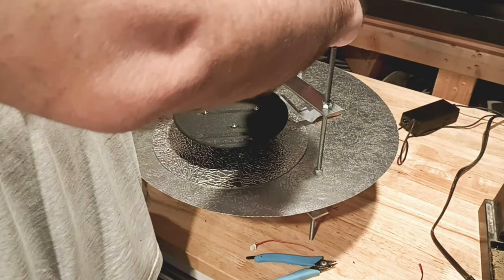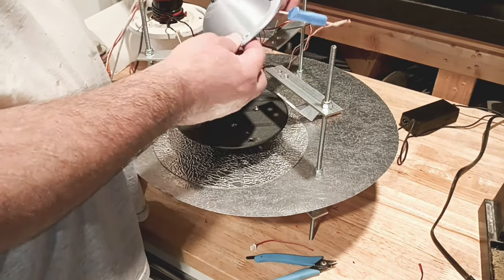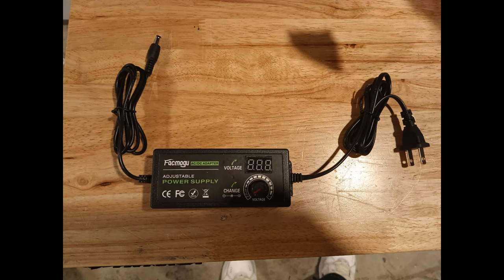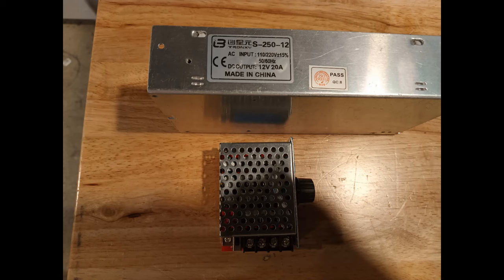It'll make a clean look out of it. The original one had everything tied in with little tie-ins, but since we soldered and shrink-tubed everything, we don't have to go through that — it's all solid wire all the way through. This is the motor driver I'm going to use — it's just a 12-volt power pack that's adjustable, running 12 volts and 5 amps. Hopefully 5 amps is going to be enough. For those who want to run a different setup, here's another one — a simple motor driver with a 3D printer power source at 12 volts and 20 amps, so there's plenty to run anything you want. Although I think if I put 20 amps into these motors they'll fry, it's available if we need it.